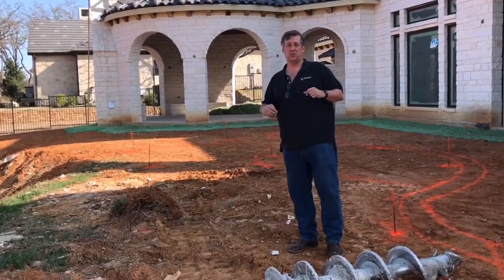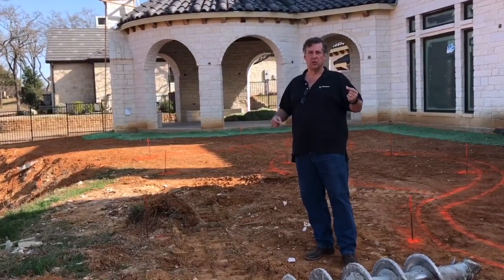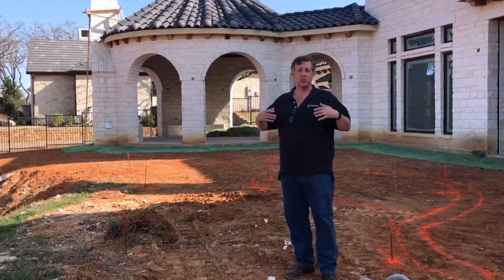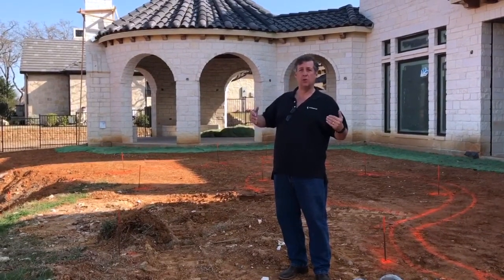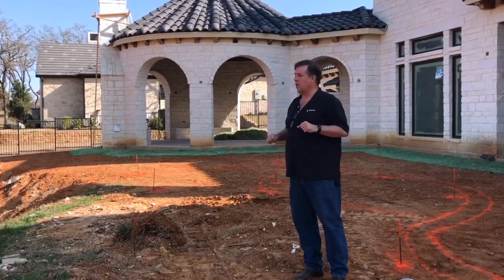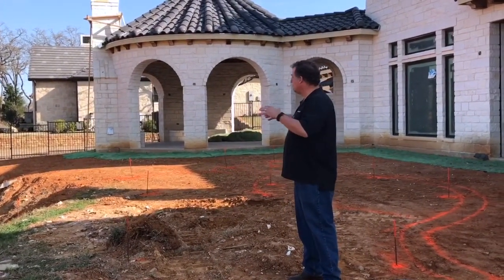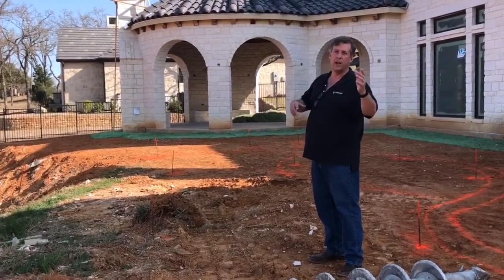The other reason is because the soil is so nasty and it moves up and down — we have to do what's called piers and void boxes. We'll show you what that looks like on a different job site down in Cedar Hill, where we have the nastiest soil in the United States as far as clay expansion to contraction. On this particular project, from wet to dry, it moves nine inches, which is huge if you're trying to build something on top of that. In soils class in college, it says put cows there — only cows, maybe sheep too, just livestock. They're going to come back and we'll show you how this is going to be drilled and poured here in a little bit.